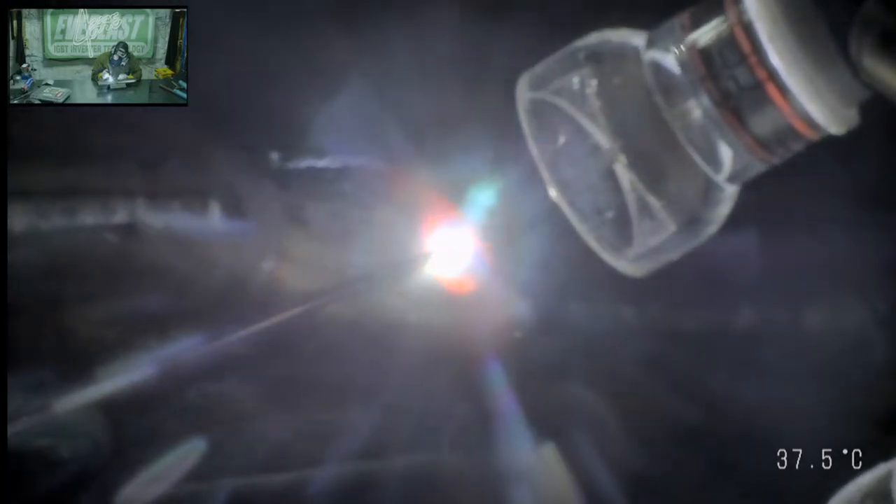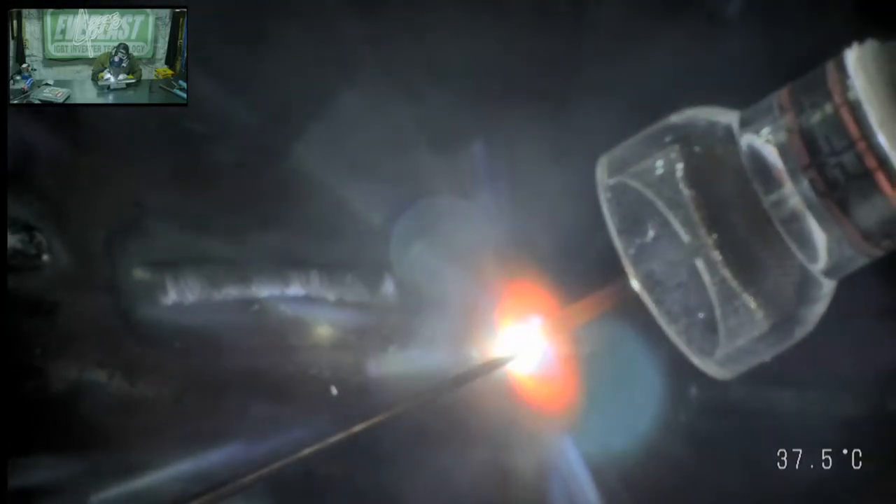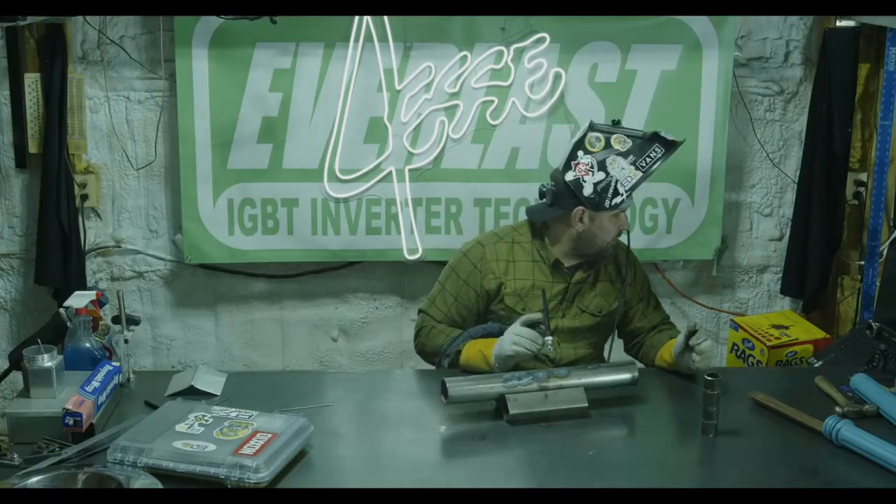All right arc shot cam, 10th time retry. So again: 2T with a two-second upslope from 10 to 71 amps, and then a one-second downslope from 71 to 5 amps at termination. We release the trigger and it tapers off nice and slow. Hit the trigger — two-second ramp up — release — taper off. How did that look guys?